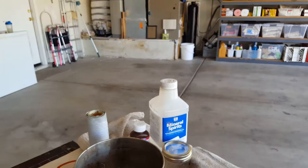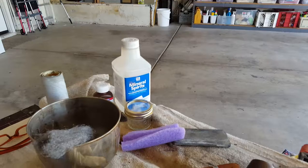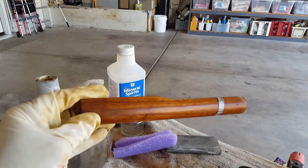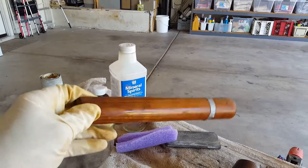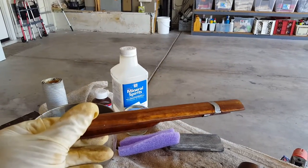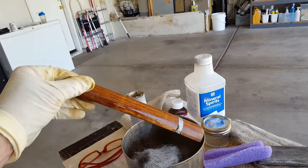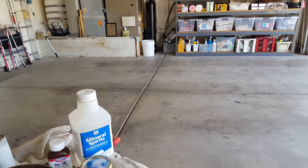The other thing I use is acetone. You can strip these things using stripper however you want, but usually you don't have to be that aggressive. Just use some acetone or some Formby's — go to True Value or a hardware store and get Formby's finish remover; it's almost like a fingernail polish remover. I use straight acetone, put it in the pot, and rub off the original finish with steel wool. It works good. Then blow it off, wipe it off real quick, and you're ready to sand.